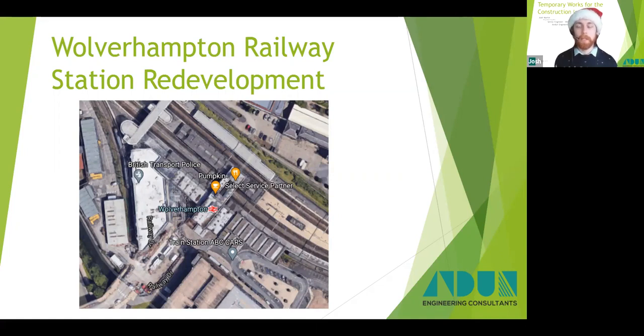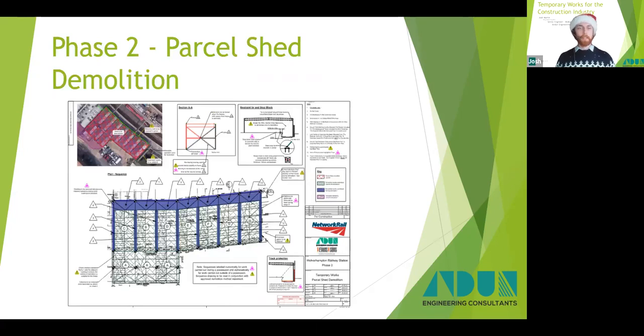The client was Network Rail, and I was the CRED and lead temporary works engineer for the demolition contractor. I'm going to run through the 3 main parts of phase 2 demolition, which were completed earlier this year. The first task was the demolition of the parcel sheds. The process here was to progressively demolish the steel portal frames that were adjacent to the railway line, and there was also a disused line within the sheds too.